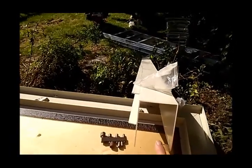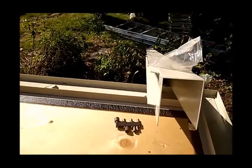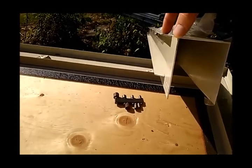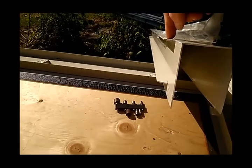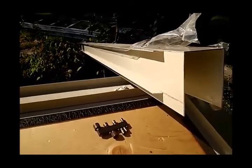The deep end, because this is a studio room, will face the house. The short legs will face the supporting wall. That's so we can notch the short legs down, and when that swivel header comes across, it will overlap these legs and give us a structural connection. So that's the notch on the corner post. This corner post has been cut to a 4.5-degree angle to match the roof pitch.